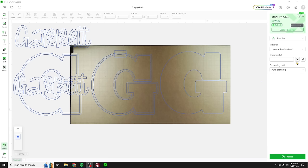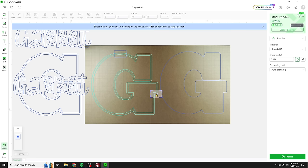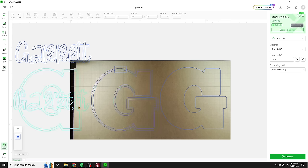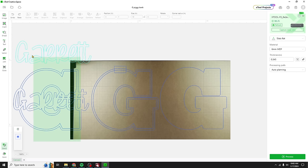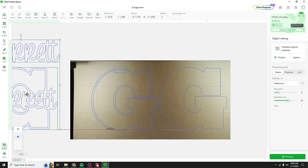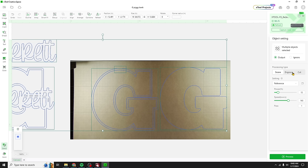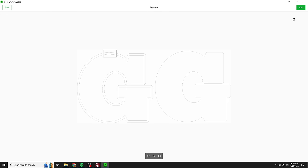Our material is loaded. We're going to measure the distance of the board, then set our material to six millimeter MDF. Only the stuff on the canvas will cut — anything touching the canvas edge will say it's out of bounds, so we move those pieces out of the way. Set the processing type to cut: 75% power, seven millimeters per second, no tabs, one pass. Process and start.